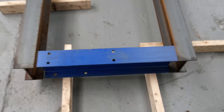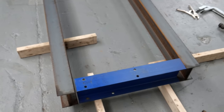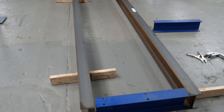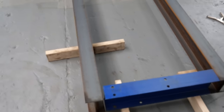I've cut some of these blue bits down; they're going to go in the middle. I've got it all propped up on wooden blocks so that it's easy to shim and tweak when it's on the floor. When you're trying to make something big and flat on the floor it only needs one tiny bit of stone or pebble to throw everything out of square. With wood you've only got two points of contact to level it on, which makes it much easier. Wood's not the best thing — bits of box section would be better — but I haven't got enough off-cuts so I'm using wood.